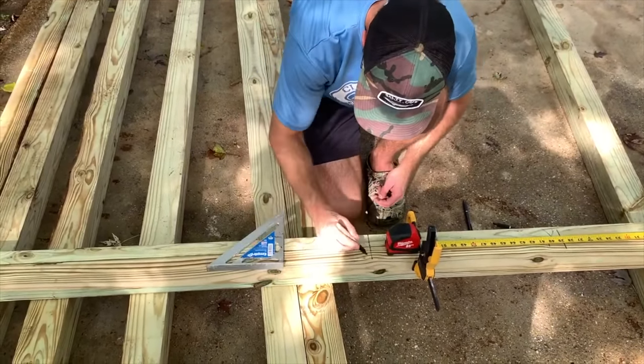And then we have our line right there, and we're just gonna line that up so it's flush with this rafter. So like that, and then we'll go ahead and screw it in place. Once you have your fascia board positioned correctly, you can screw it through the fascia board and into the rafter behind it. I use 2 screws to go into the fascia board and into each roof rafter. Then I just remove the temporary brace once I've secured the fascia board to the outermost roof rafter.